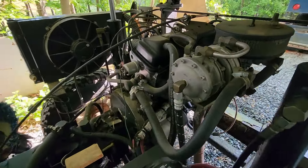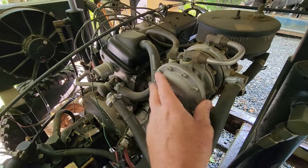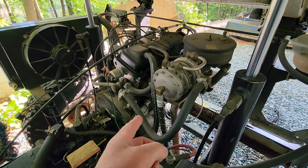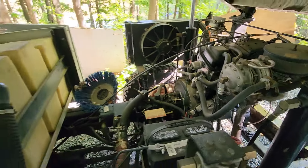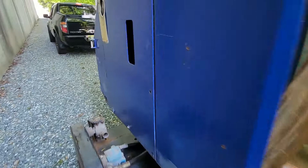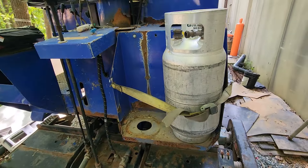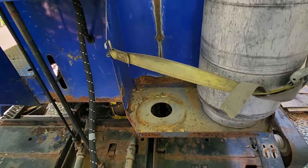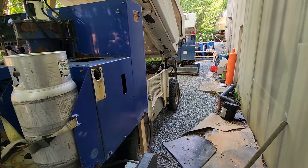There's a little bit involved here. What we're going to have to do — as you can see we have our vaporizer for our propane and it is carbureted — we're going to remove that entire intake manifold assembly, all of our fuel lines. We're going to disconnect some of our coolant lines, and going back here we have our tank bracket, our tanks, our tank valve, and the lines going to the engine. All this stuff is going to need to be moved over to the gasoline Zamboni.